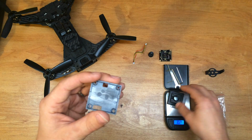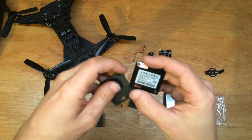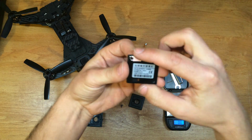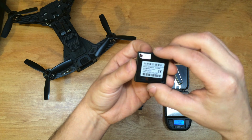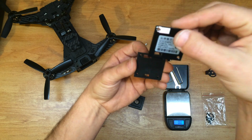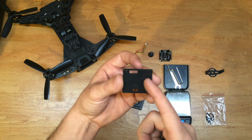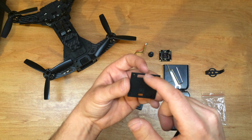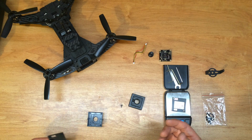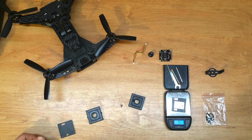The other mod you'll have to do is the back of the camera, the bottom side of the camera. You see the port hole where it plugs in is a little off. The bottom hole is off to the left further on the stock one, so I'm going to have to take a Dremel and cut into that a little bit. I figure while I'm at it, most of this back piece is not even needed, so I'm going to cut some weight off there. But to take this off, take it apart and install the plastic casing, it's really pretty easy. There's nothing hard to it.